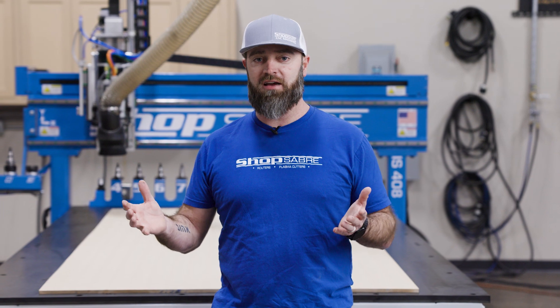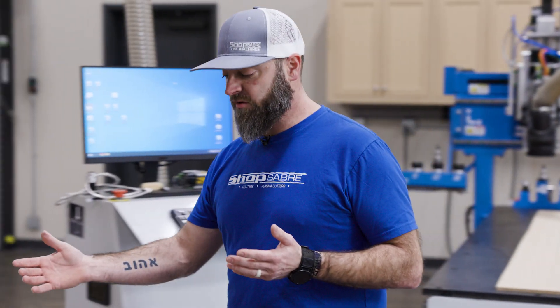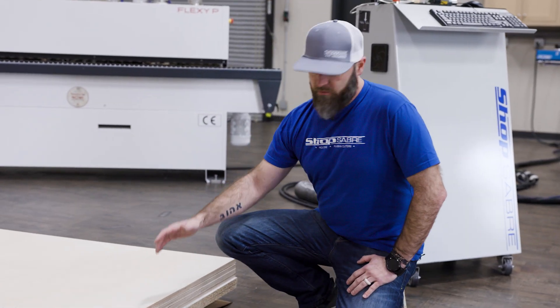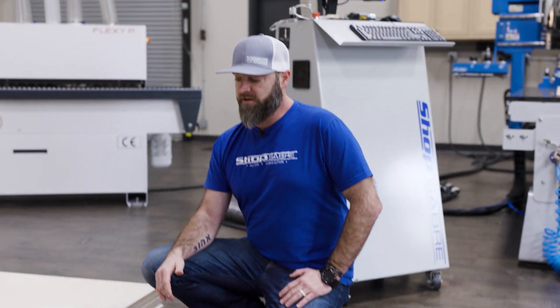So if you caught our last video, we finished up the showroom cabinets, got everything put together and installed, and thought it would really be nice to have a workbench to put all these together on, like we do back in the shop. So we ordered up some material, we decided we're going to build a torsion box workbench. We've got Baltic birch for the majority of it and then I wanted to do a melamine top just because I like that for the smooth surface and kind of easy cleanup.